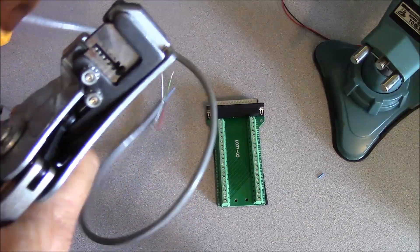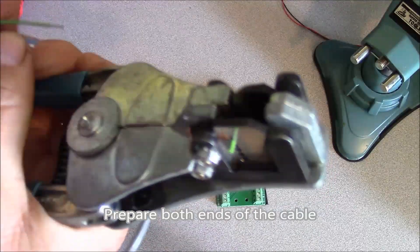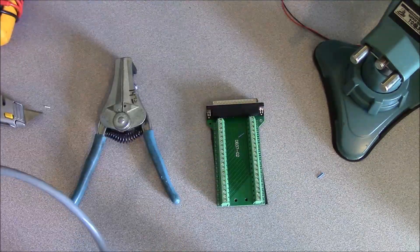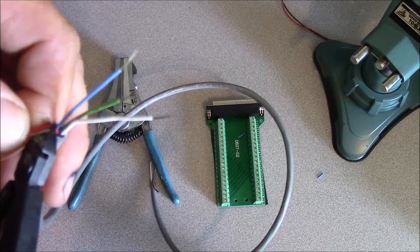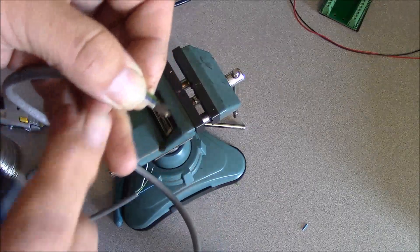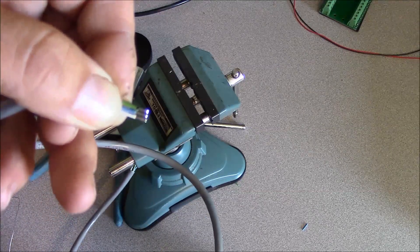Go ahead and strip your cable ends at both ends of your cable, and just expose enough to make connection — about that much is all you want. The shield and the additional conductor are superfluous at this point, so go ahead and trim those back to get them out of the way. Flux and tin your conductors on your cable. After doing that, line up all of your conductors evenly, and taking a pair of precision cutters, cut your ends to uniform length for the DB9. You'll want to bridge pins 7 and 8, so take a small amount of flux and make yourself a solder bridge.